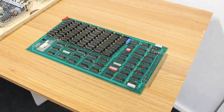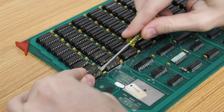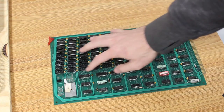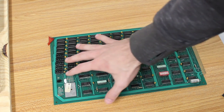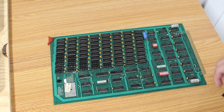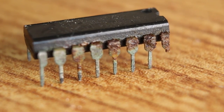Speaking of cards, I want to use the memory card from the counterfeit machine, but it has some serious water damage, so I'm hoping we can fix it. I'll carefully remove all of the corroded chips from the sockets, but some are so bad they're coming apart in the socket — truly a ton of corrosion. The PCB looks pretty good; it looks like the solder mask did its job and protected the traces. The main concern is one particular socket where pin 16 broke off and is still stuck inside the socket — I can actually see it in there.